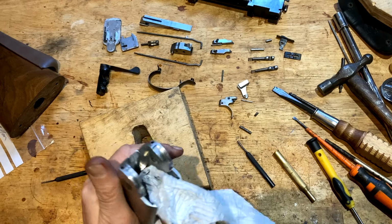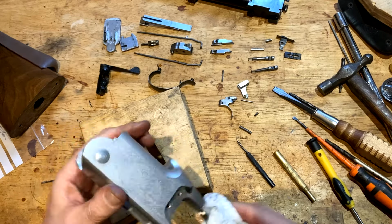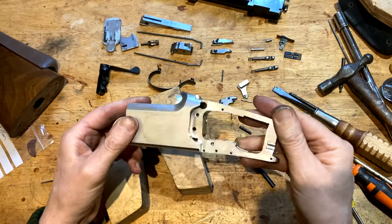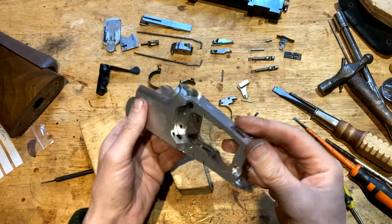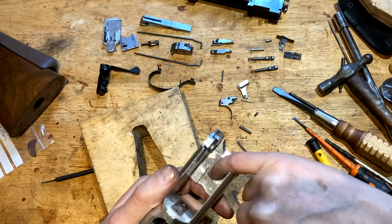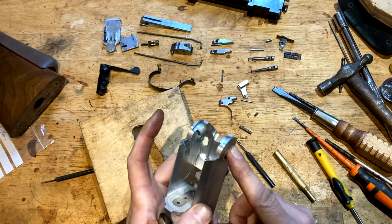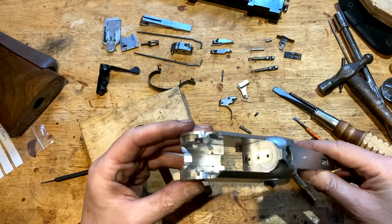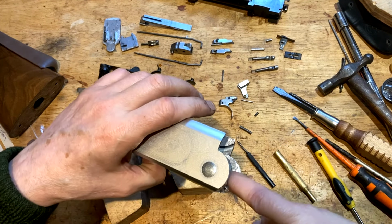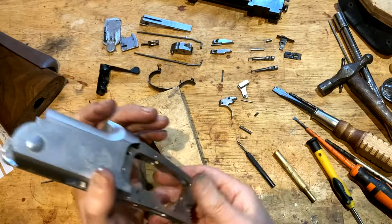And there's nothing to report. This is in absolutely great condition. So it's just light lube and reassemble. But you can see that is a complete CNC frame all in one. In fact, you can still see machining marks here where they've counterbored that there. Other than that, there will be two hardened steel hinge pins there, which we're not going to interfere with. Although delighted to see they've got Allen key hex screws there, so you can actually unscrew them and replace them. Very good design feature.